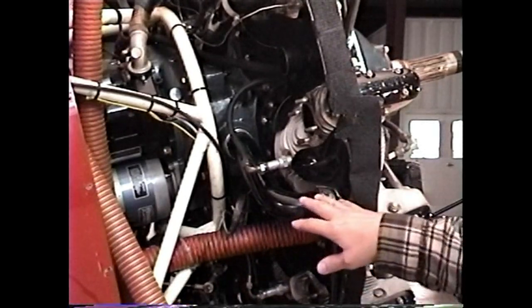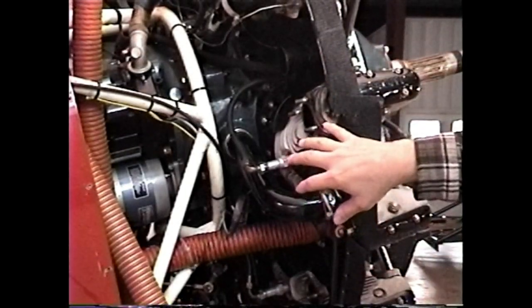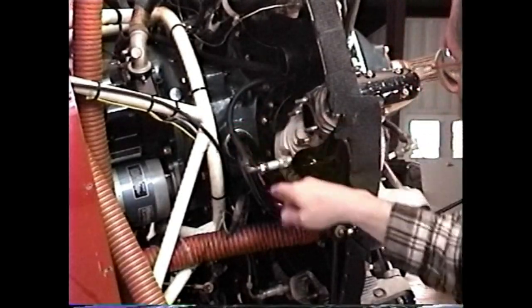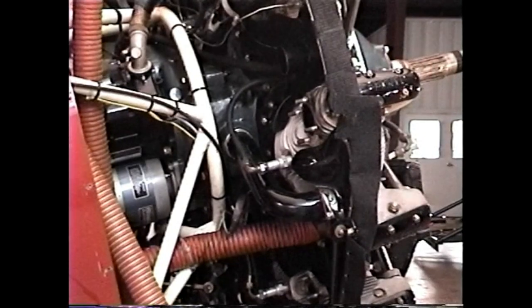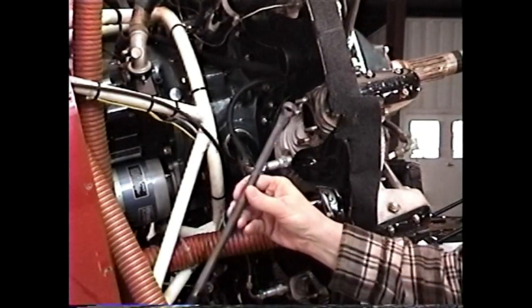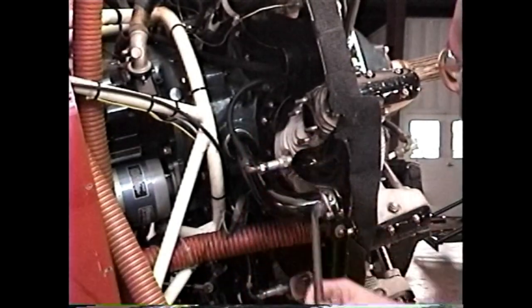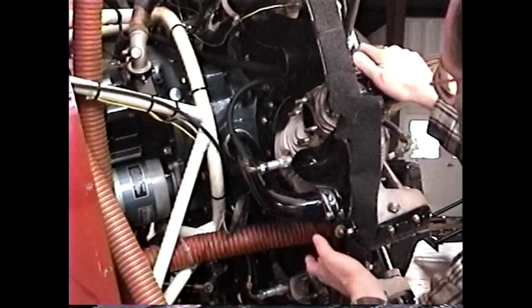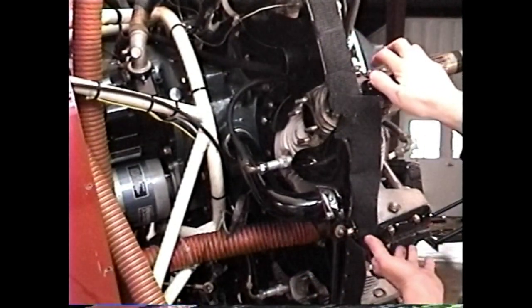Now once we've done that, we've got the cylinder completely free from everything that attaches it all the way around, and we can go after the cylinder base nuts. There are 12 cylinder base nuts located all the way around the cylinder. We'll use our cylinder base wrench that we made earlier to remove all those nuts. Now once we've removed those nuts, we'll want to shake the cylinder loose and extract the cylinder from the case